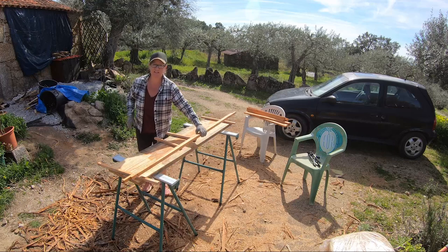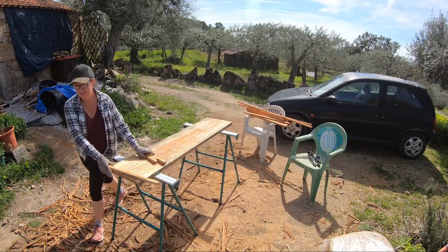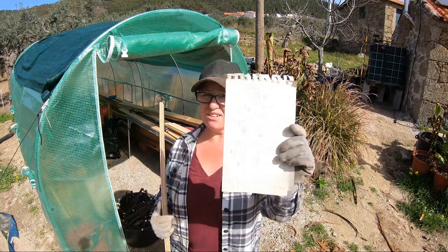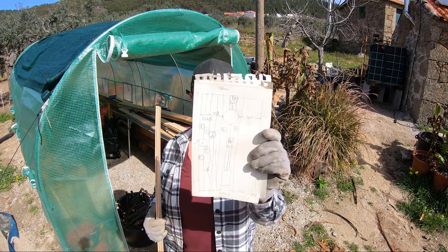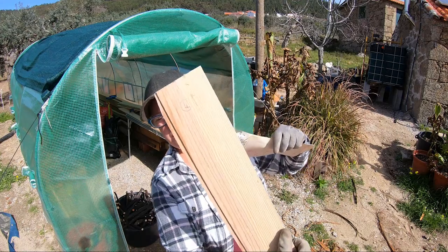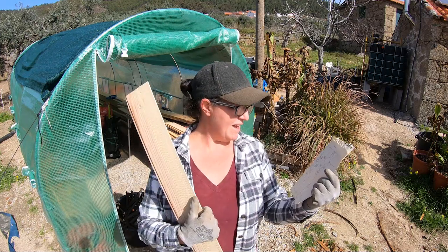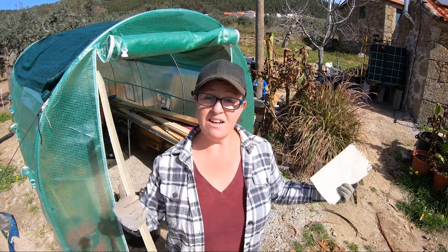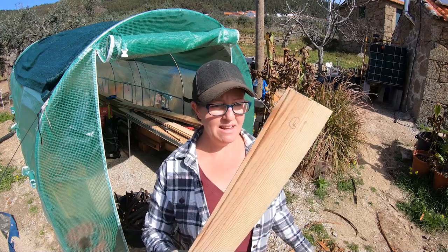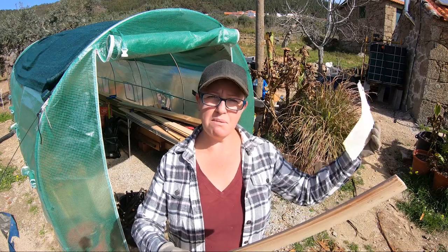As some of you might know, I make maps for a living - street maps - but I also like a good door map. I've marked the pieces on this drawing, cut them to size, and on each piece I've also put the corresponding letter. These are the pieces I have ready to go, and they're probably the only pieces I'll have ready today until I get into town and get more wood. My plan is to linseed oil the backs only, and then when I'm finished the entire door - all the pieces - I'll sand everything and linseed oil the front probably when it's in place.